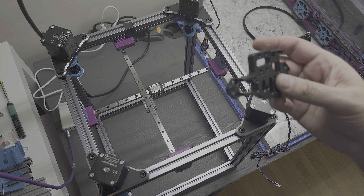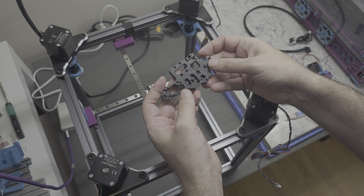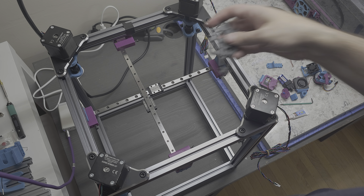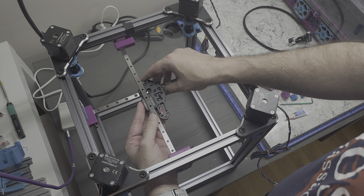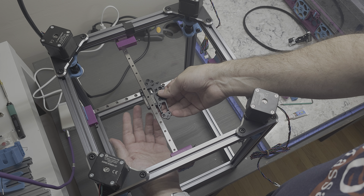The center of the toolhead on the Annex K3 is this piece — I have a CNC version, but there are plastic printed versions available as well. It's known as the party plate, so all the various parts of the toolhead will attach to this central plate. It sits in this orientation on the printer and connects to the X and Y carriages, with screws through the top and from the underside into the carriage. That gives us the platform to add the fans, extruder, hot end, and in my case a beacon probe on the bottom.